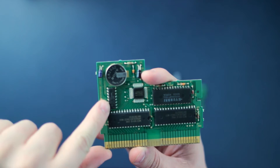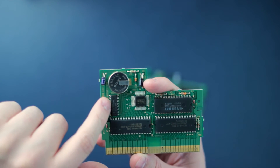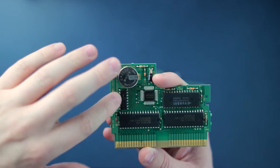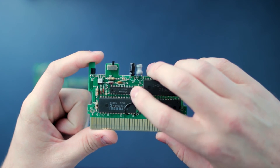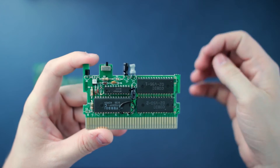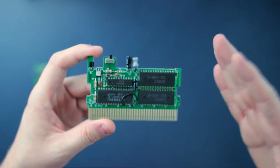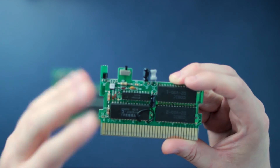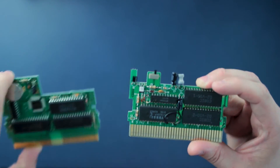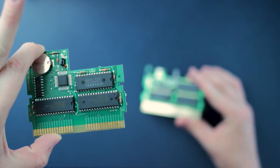This little chip right here is the lockout chip I was talking about — it's called the CIC — and it's the chip that communicates with the corresponding chip inside the NES. And this chip here is the Camerica glitch chip: the one that sends glitchy packets of data to the chip inside the NES, causing it to freeze and basically bypassing it altogether. It has a wire soldered to two different pins and has a lot more capacitors and resistors. Basically this looks like a hack job, whereas the licensed game looks like an NES game actually should look.